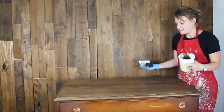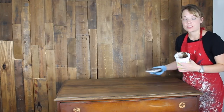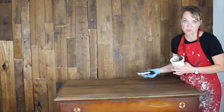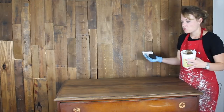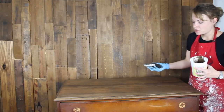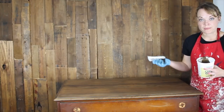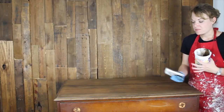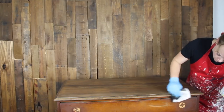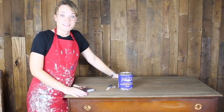This is finished. Let's talk about dry time: it's only going to take two to four hours to dry before you can start the top coat process, so this is much faster than oil-based stain where you need to wait 24 hours. It's really not smelly — I don't smell anything standing right next to it. It's also water-based so it's washable; if you use a brush you can just wash it out. You don't have to throw anything away. I'm just going to let this sit and then we'll be back once it's dry to start our top coating process.